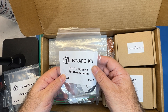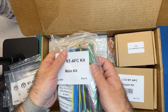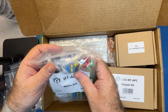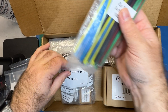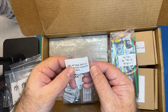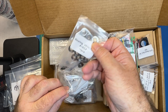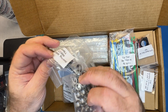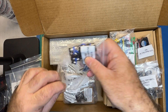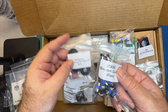Got the TN buffer for Box Turtle hard mounts. In the main kit, there's quite a bit of stuff, including some multicolored zip ties. We've got some little gears for the respooler, a fan, bearings — quite a bit of ABEC-7 bearings — some magnets, Bowden couplers for the PTFE, and some helical gears made out of nylon.